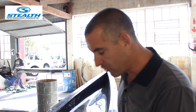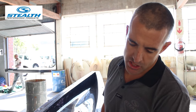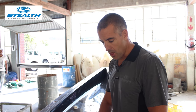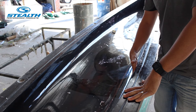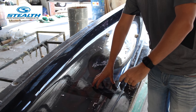What you see here now is an actual finished mould. From the plug, this is what comes out — the actual mould. This is an older mould. The mould itself, as you'll see, is very shiny with a very good finish. The better the finish on your mould, obviously the better the finish on your product. So a lot of time is spent on making a mould for us to be able to reproduce the kayak.